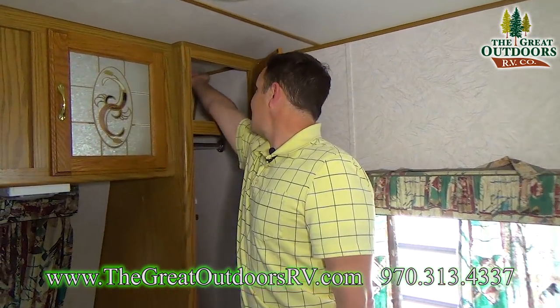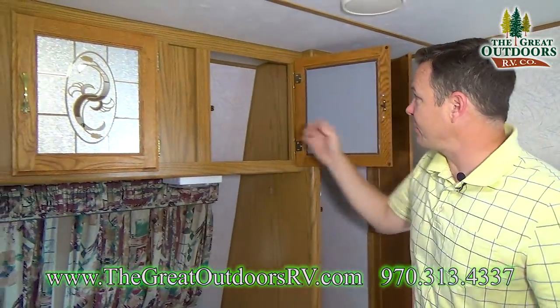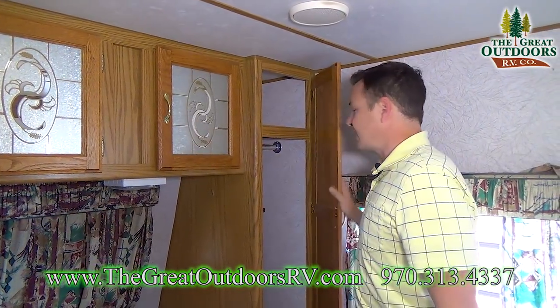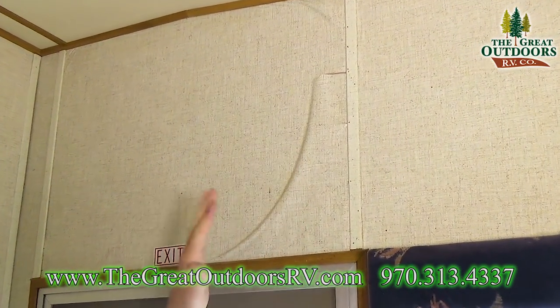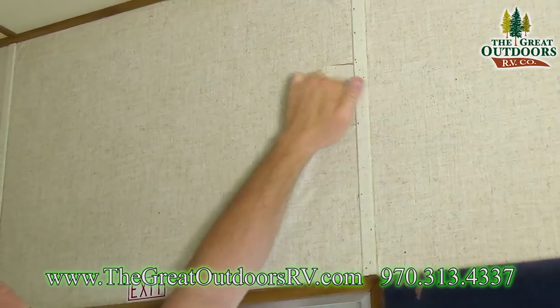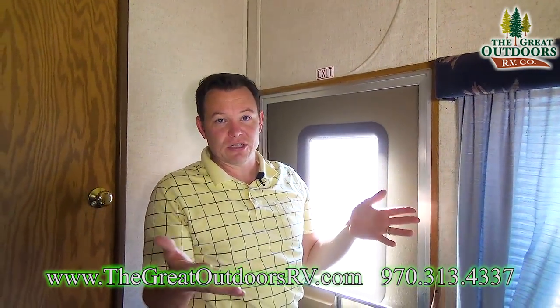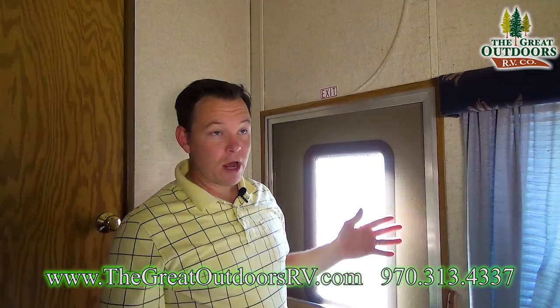Open up the cabinets and make sure the side walls and front are all nice and tight with no water damage, because sometimes that's hiding inside the cabinets, especially in the corners and sides. Also look for wallpaper that's starting to peel and delaminate from the wall. Knock on that area to see if it's solid — if it is, the glue probably just failed in the heat. But if it's soft, that can indicate water ran down and caused damage.